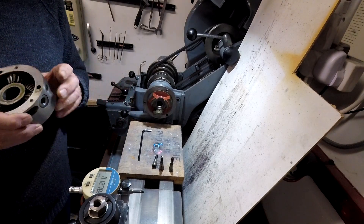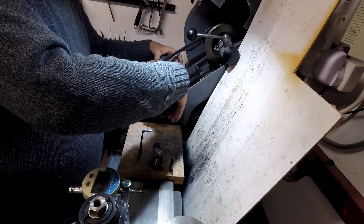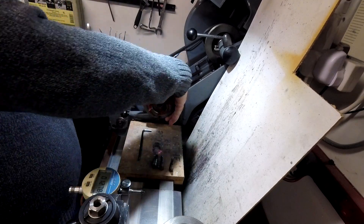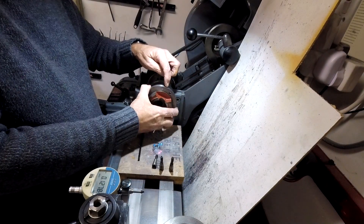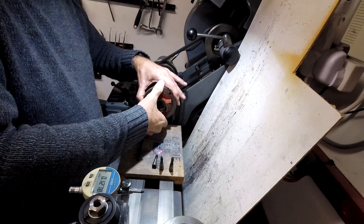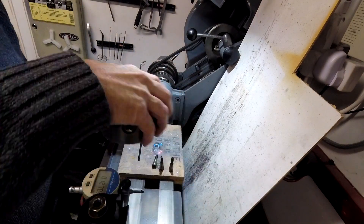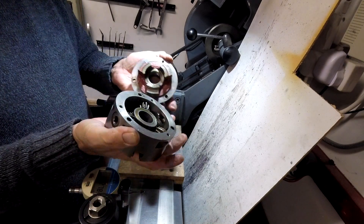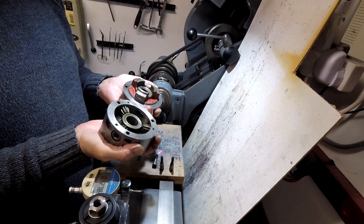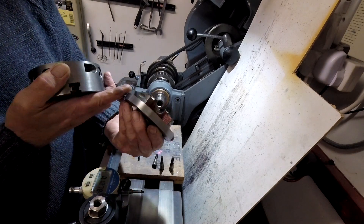It looks like it's been put together with a bit of grease. You can see how it works now. I've centre-popped this and I've centre-popped the chuck face so I know which way it went, to get the orientation correct. I've read different things about adjusting it — saying that you undo the three screws at the back so this will move around. I couldn't get it to do anything and wasn't convinced that's how it worked. However, it would seem that is how it works, and you can see marks in here.